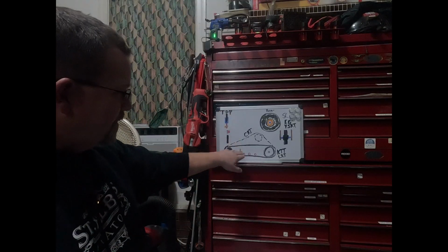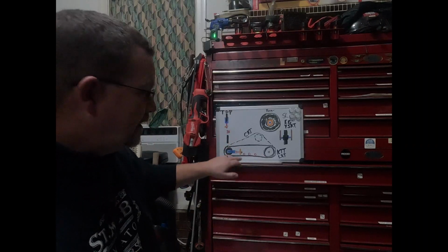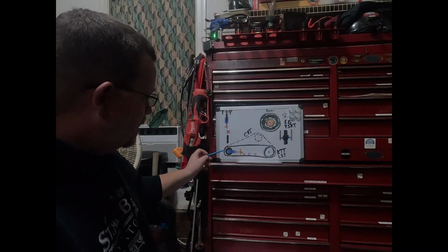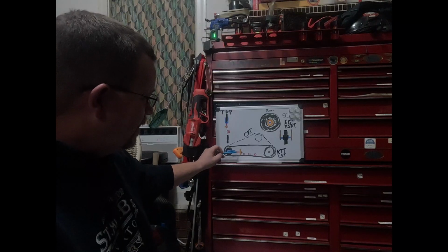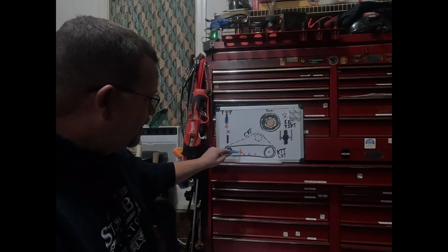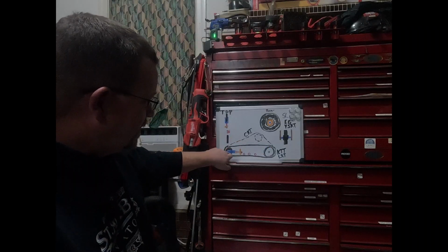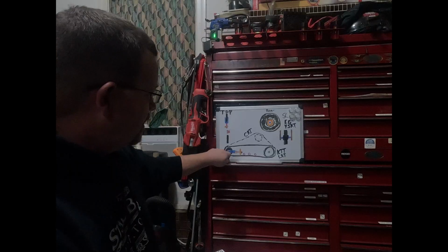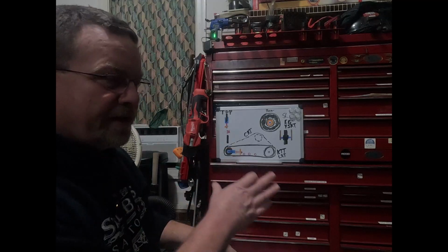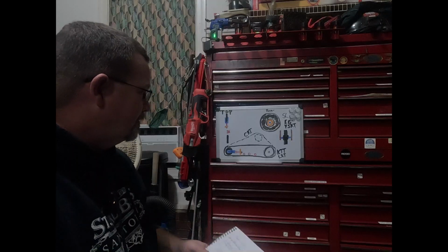Okay, now this is just kind of like a simple configuration of the front end idler assembly that puts the tension on your tracks. Okay, so you have your idler wheel, idler frame, you have a spring that sits in here, kind of keeps the tension on it, and then in here is either the shaft that has got the nut keeping the tension, that's screwed in and keeps the tension on the idler, or it's kind of the shaft that goes in here and puts pressure with grease inside the idler frame. That's it. It's fairly simple.